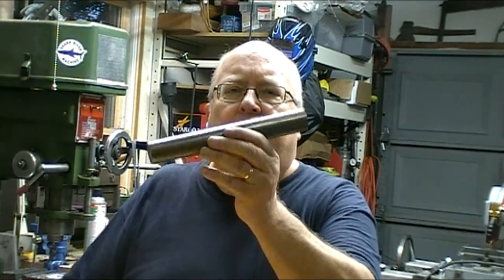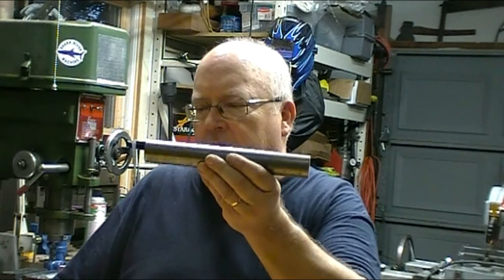In this video I'm going to make the arbor. I'm going to be making it out of a piece of stress proof — if you watched Shark Bits number seven you'll see that I just bought this stress proof on eBay. I got a couple of drops and I think it'll be a great material. I'm doing all of the machining in one setup so that it will be concentric and I don't have to worry about the arbor itself being out of balance.